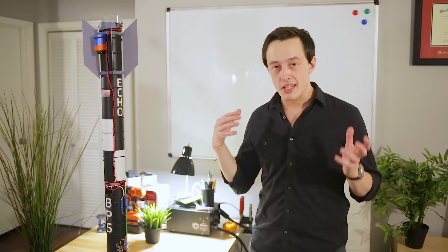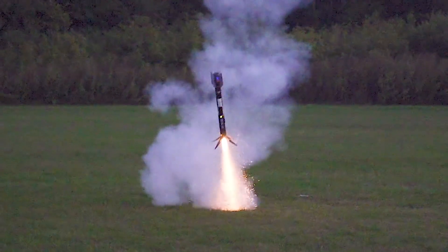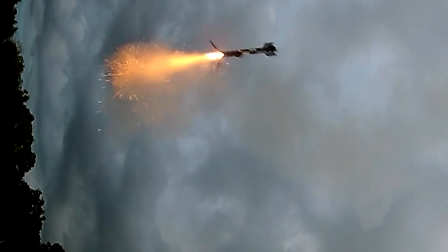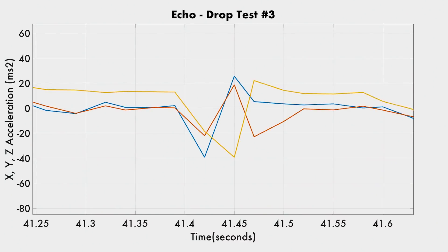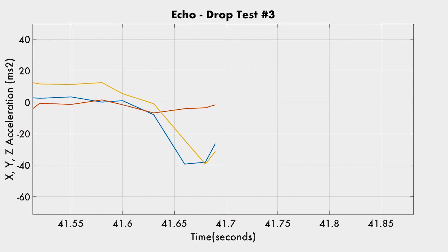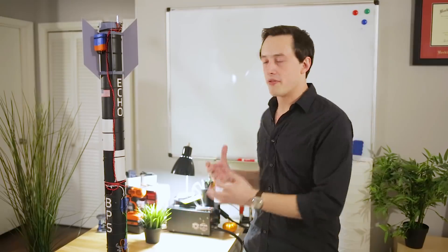As the vehicle approaches the ground, we start to see the second major problem in this test, which is that the vehicle isn't holding itself completely upright. By not being locked at zero degrees on the x- and y-axis, we start to induce some horizontal translation into our flight, so the rocket starts sort of power sliding along. At 41.2 seconds, we see impact number one — where the legs make contact with the ground — visible in the acceleration measurements. At 41.4 seconds, we see the second impact, where the vehicle tips over and hits the ground, knocking off some of the fins on top. And then at 41.6 seconds, we see the final burnout of the retromotor.